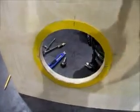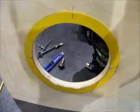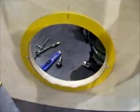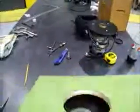I'm not 100% sure on that rabbet bit. It looks like it's a Taiwanese deal, so whether or not it's exactly a 1/4 inch. So I'm just going to put some tape to fill the hole and check the router base, because I want to end up with a pretty good fit. So I'll go ahead and do that, and we'll give that a whirl.